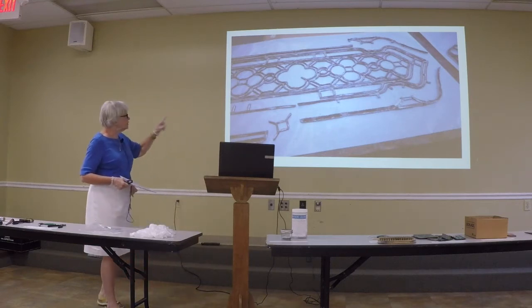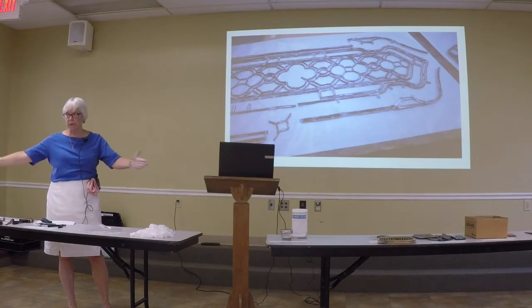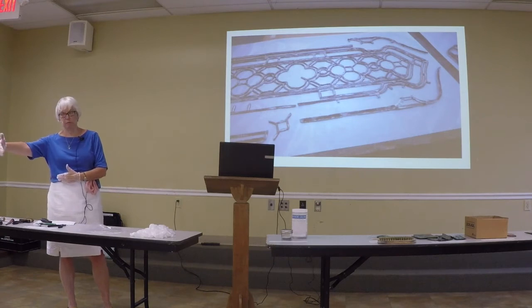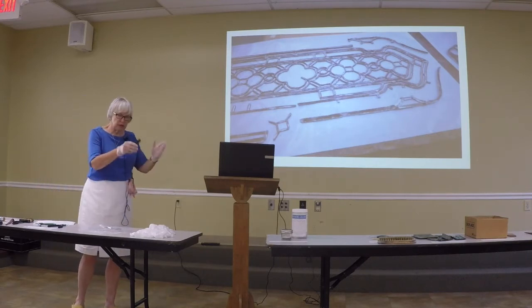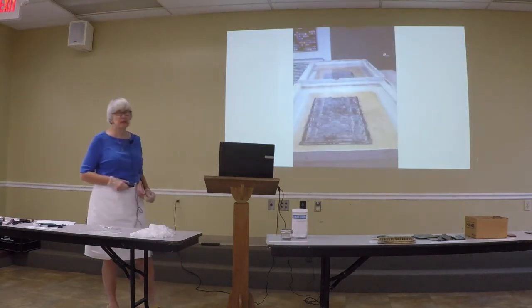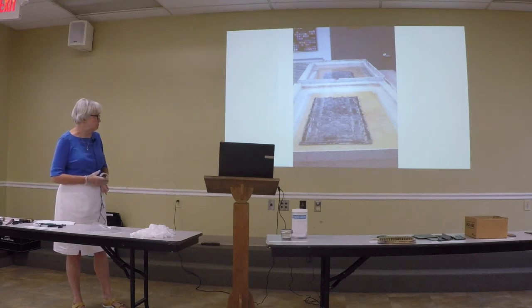As he takes each piece of glass out, he's got another piece of glass. If you think of just an oversized piece of glass from a picture window. And he'll put each piece of glass on this tray of a plate glass in the exact same order. Now, immediately he's putting it down freehand, so making sure he's got it all spaced right. Because then he puts it in a water table and it'll sit here soaking for 72 hours. I was surprised, there's no soap. You just soak it. And it really, just soaking seems to take care of a lot of problems.